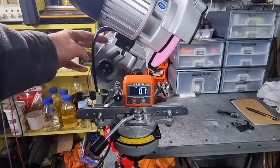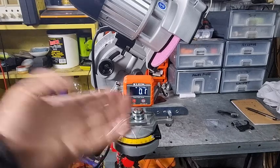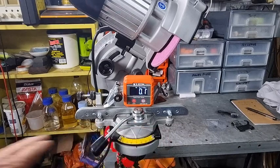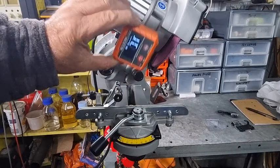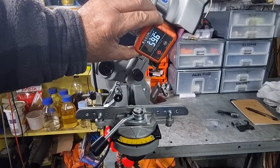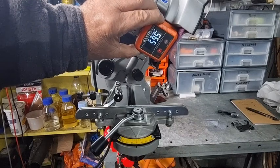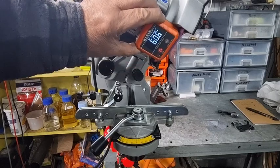This is the top plate cutting angle, and even on the vice on the other side, the graduations - some people are saying they're not accurate. Anyway, I've used this digital angle gauge to check angles and I've zeroed and leveled it. If we use the gauge on the wheel - look at that - 59.6. So it depends where you measure on the wheel because the wheel is sometimes not perfect, but it's pretty spot on.